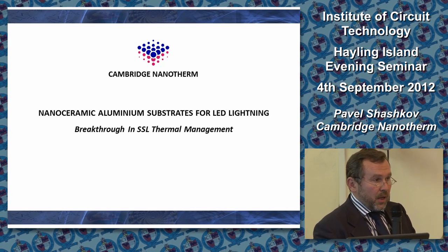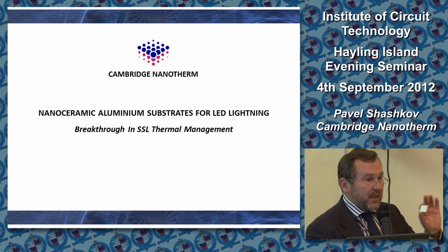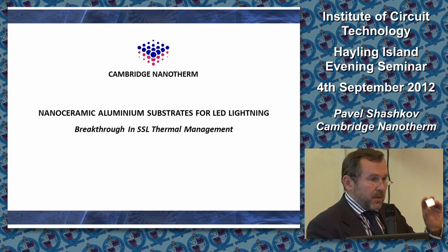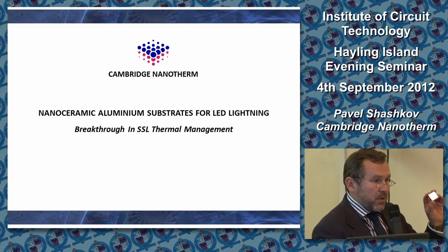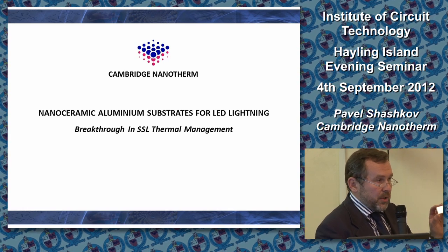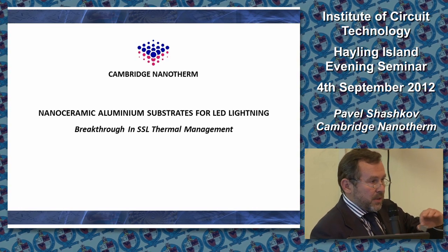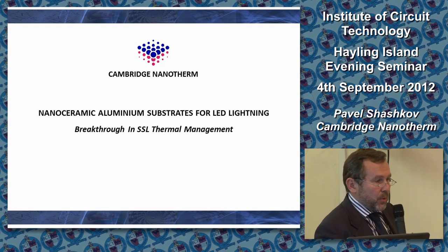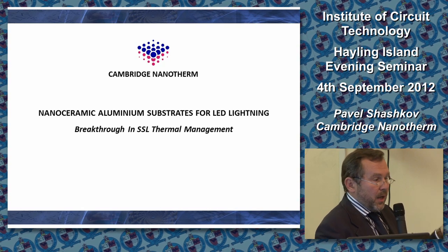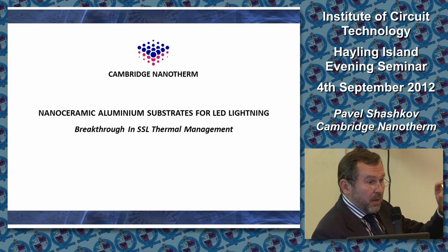The trick is how you apply this material. It's made electrochemically. It's made in a tank. It is not anodizing. It's a different process which makes a very fine nanocrystalline size oxide on the surface of aluminium. And you grow it with a certain speed and you can control the thickness. It can be as thin as 5 microns, and at 5 microns you have quite uniform layer, or you can grow it as thick as 50 or 60 microns, depending on what you really want from this substrate, how much breakdown voltage you want from this dielectric on top of aluminium.